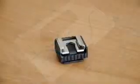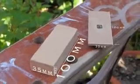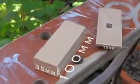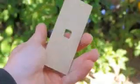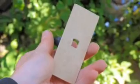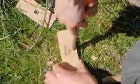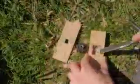The first thing to do is to build the frame, starting with the tripod mount. Get a camera shoe mount adapter and trim off the excess plastic around the thread on the bottom using a hacksaw. Next cut out two 35 by 100mm rectangles — one out of 6mm MDF and the other out of 18mm MDF. Drill a hole in the centre of the thinner rectangle for the trimmed shoe adapter to fit through, using a coping saw or file to make it square. Then use a chisel to dig out a hole in the thicker rectangle for the shoe adapter to fit into.